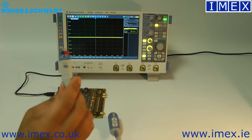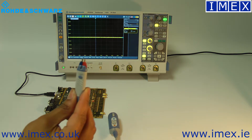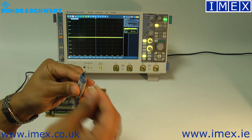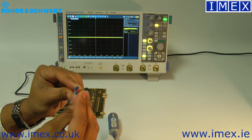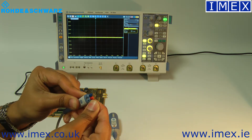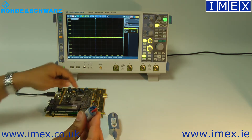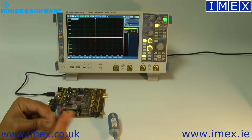The good thing about these are, as you can see, the plus and minus — they're completely differential. They have a variable pitch width so you can take them off and add accessories. By changing the angle you can change exactly where you are measuring. So you've got various different zones for ICs that you want to trigger on or look at, and you can quickly change that.